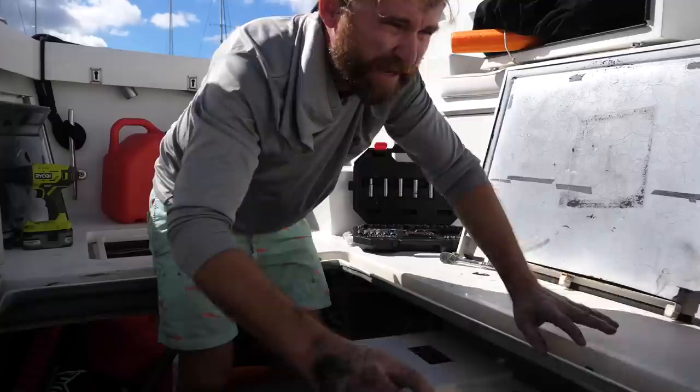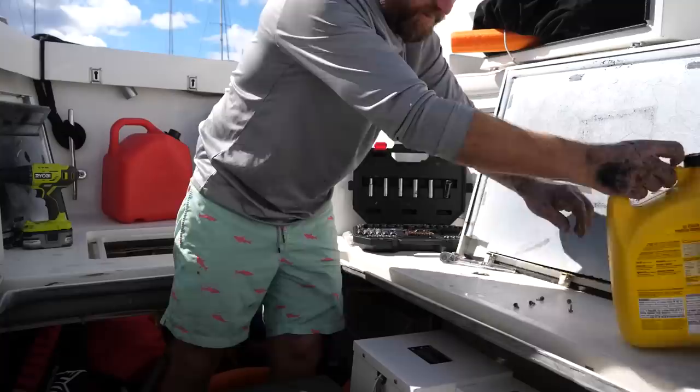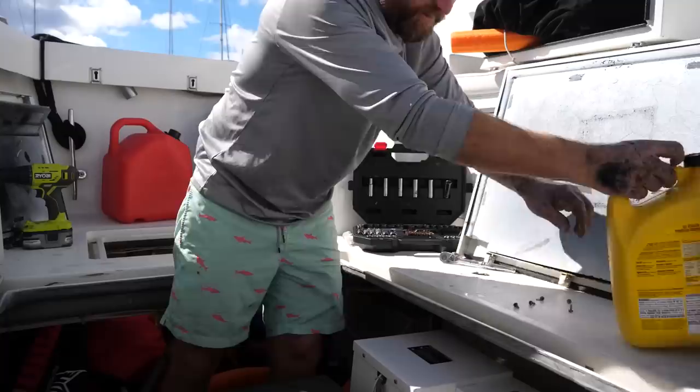It's not hot — I only ran it for about 30 seconds. I'm going to open this up and there's a little bit of gap, so I can put some more coolant in there. Now before I really put the box back together, I'm going to let this thing run for 20 to 30 minutes and make sure it doesn't get hot.